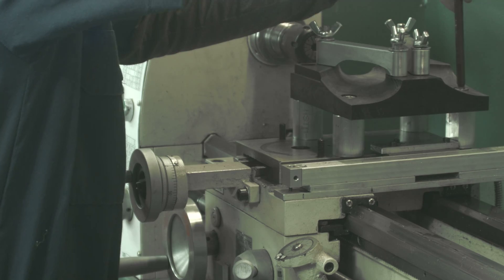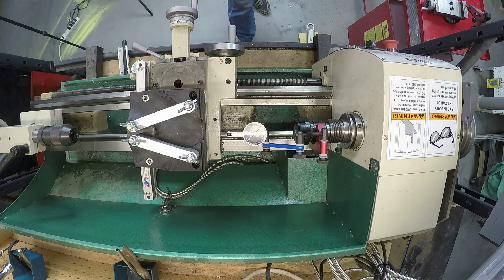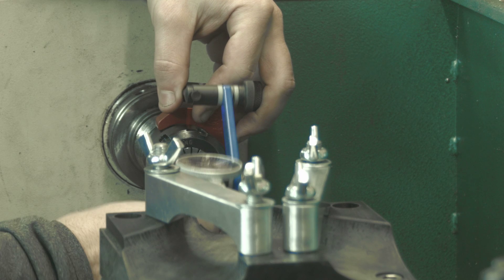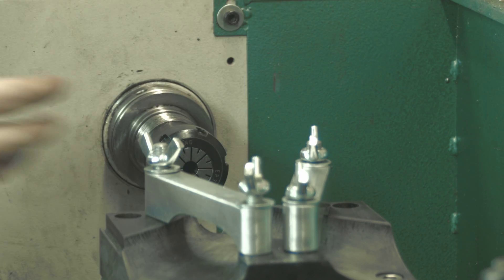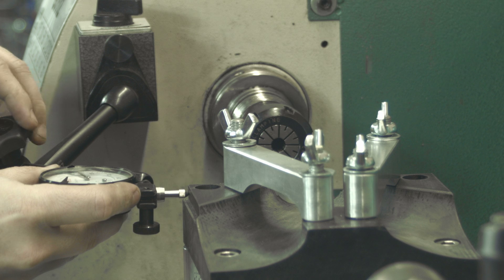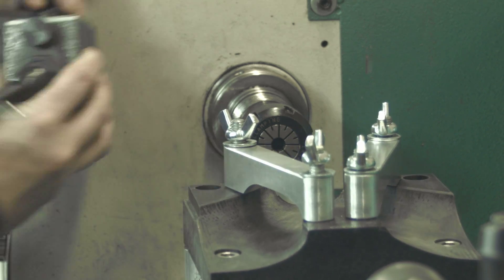Standoffs set the correct height for the fixture. The fixture is made out of ABS plastic, which is easier and faster to machine than aluminum on our CNC routers. Unlike wood, ABS is also unaffected by oil and water. Because the clamping brackets are thin, they had to be 3D machined out of aluminum. Because they're fairly small, it didn't take too long to make them.